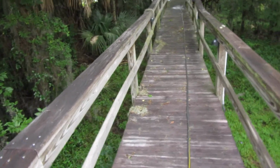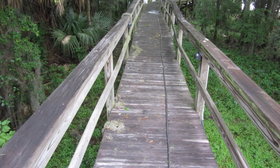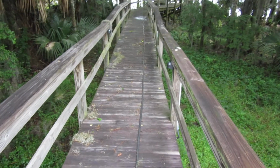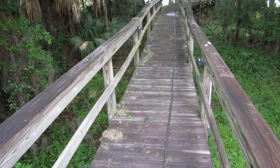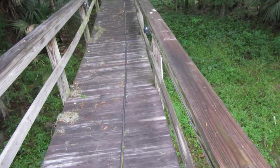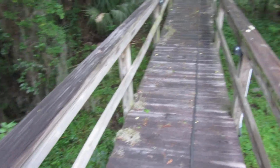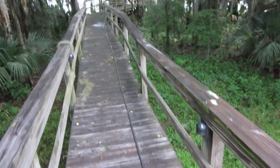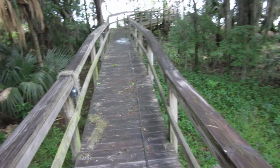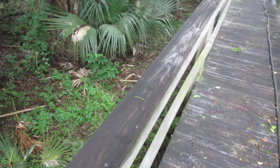And the reason for that is paint is a lot more durable than a stain, but you can't use the paint on the decking here because paint's definitely not meant to be walked on. So the paint's going to hold up longer against fading as well. We're going to do these top caps that really get beat by the sun with the paint, and all the decking is going to get a stain. That way it'll penetrate deep into the wood. You can walk on it, no problems. The top caps will get the paint.